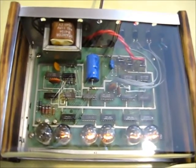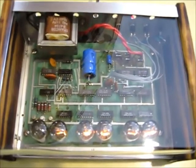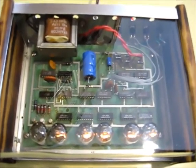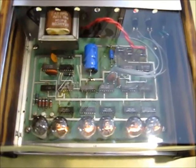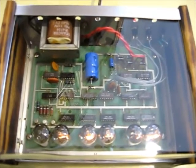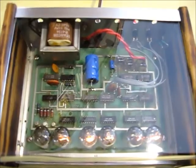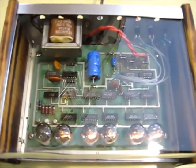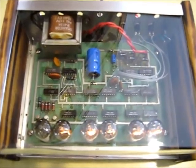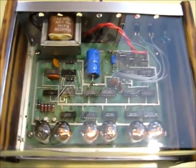The work I did on the board is pretty limited — changed the filter cap and there's a timing capacitor which is electrolytic; there are some missing components. The history of this board: it just came as an orphan board with no case, as I mentioned earlier. But this was set up for 50 hertz, 24-hour time, so I wonder where this came from — must have been overseas. Here in the US you usually do 12-hour time and 60 hertz, of course. So there's a little jumper on the board for the 50 or 60 hertz selection, and a few other components rearranged. The board is all set up — you just move a few components and off you go counting 12 hours. So that's what I did, and that's where we're at.